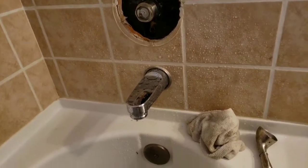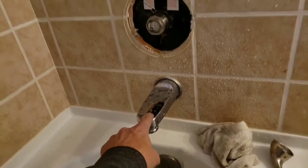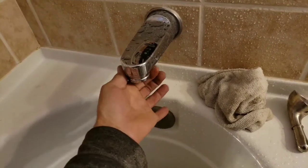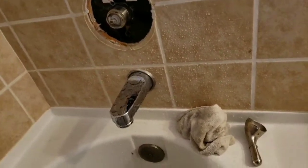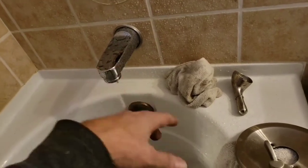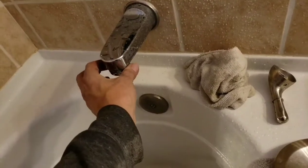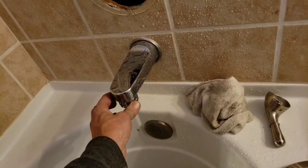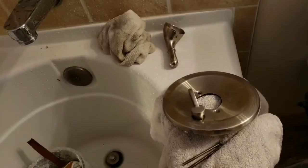So our solution today, and a previous plumber had tried to put on a Delta style tub spout of a different color, and it has a diverter on the end here. So when the water's running, you just pull this down, and that would stop the water at the faucet, at the tub, and that would push the water back up. The problem is that the other diverter needs to work as well. So the other diverter stops it regardless. If it's turned up to the shower head, then no water comes to here to get stopped. If it's turned down to here, and you pull this, no water goes up because this is turned to the tub. So we have a catch-22 here with this Eurostream